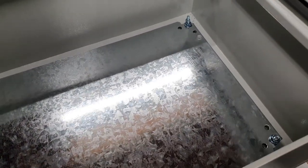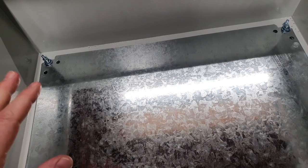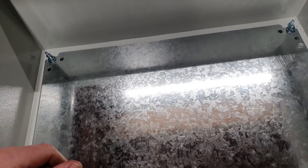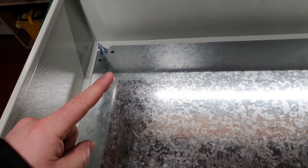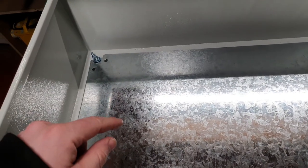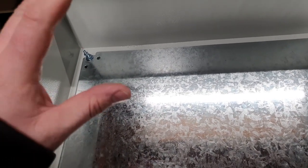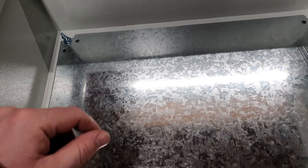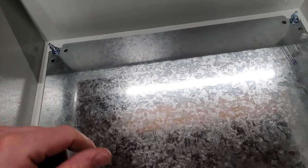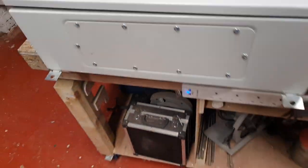And just tidy the whole thing up. Oh, I also want to put some fast-acting fuses in front of the solid-state relays, so we can protect them a little bit, although I shouldn't need to. I think what caused that failure was the capacitance of the cables creating a fault current on the switching of the solid-state relay, so it was switching too fast or randomly. And they're zero crossing, so I don't know whether that has an effect in making them blow up or not, but one certainly blew up, so there we are.